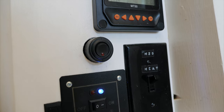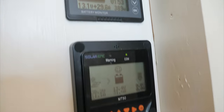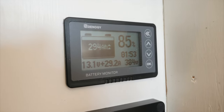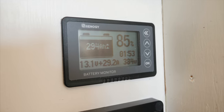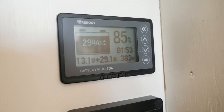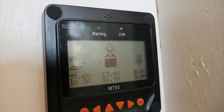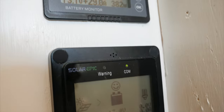The hot water is fully hot. Turning off the hot water heater, we can see it took the battery down to 294 amp hours — so it used 55 to 56 amp hours, which is about 85% of our usable amp hours. That was with the solar charging above 30 amps the whole time, so it would have taken significantly more if this was done at night.